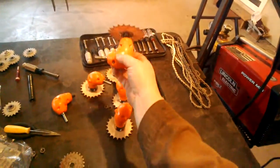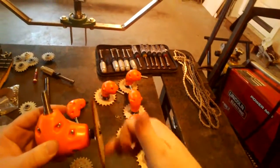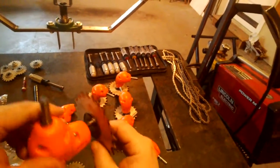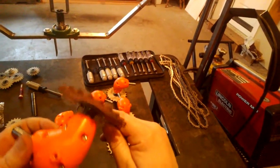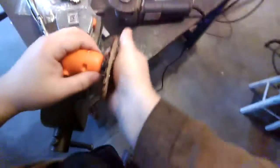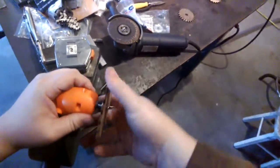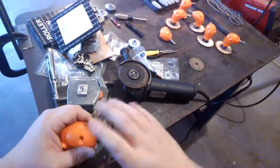We've removed all of the right angle drives with the sprockets from the prototype. It's now spinning free. We need to remove all these. Of course, these have all been Loctited in place, but only with the lower strength Loctite. Eventually I will probably just end up welding them in place, but I want to be really sure I like what I have by then - I'm glad I didn't with the wood sprockets. I can just break this loose with enough force; they're not on that solidly. I had at least one break free while testing the prototype, even with the janky wood sprockets. Just like that - another five to do.